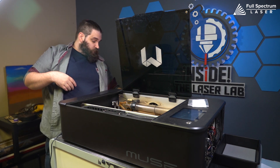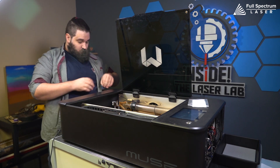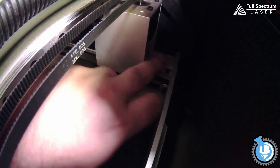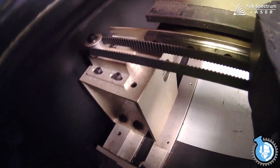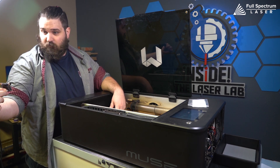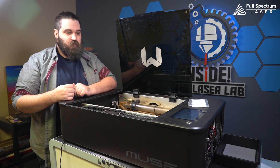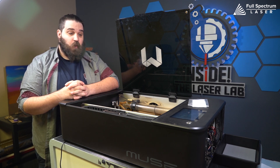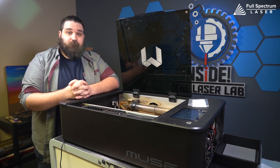Now we should be good. Let's move our laser and check with our camera once more. I have it moved all the way to the front - no space here, and no space here. So we are good. Our gantry is square once again. It's super simple, I hope that helped everybody. After this point, you're just going to want to unlock your gantry and make sure your laser homes, and you'll be done after that. Thanks for watching - if you guys have any more questions about maintenance, hit us up in the comments or talk to us on Facebook. Until next time, keep making.